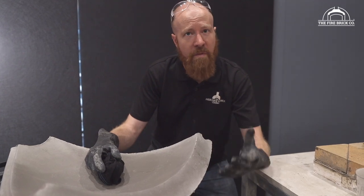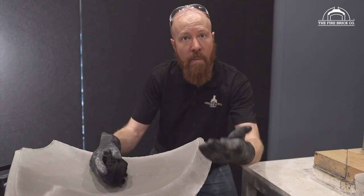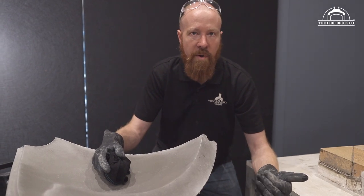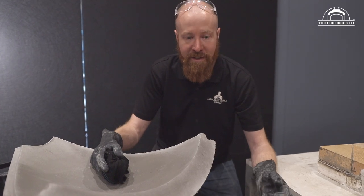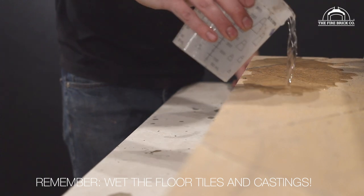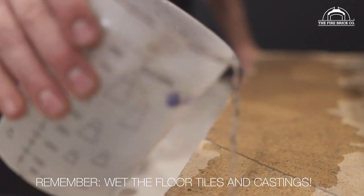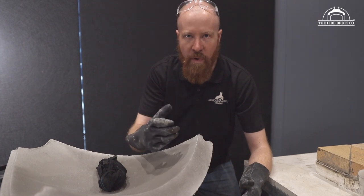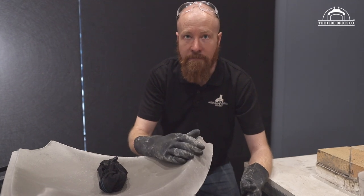Fire bricks are very, very porous. So if they're loose, like you saw before, when we laid the fire bricks, we soaked them in water before we laid them. But you might have laid your fire brick floor a week ago and now it's bone dry. Now we can't put it back in a tub and soak it again. So what we do is we actually pour water onto it and let that soak in. And I'll usually do 3 or 4 pours of water over the top. You could use a hose if you want. We just want to saturate those bricks